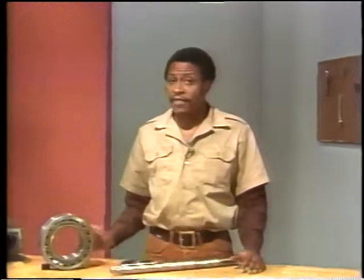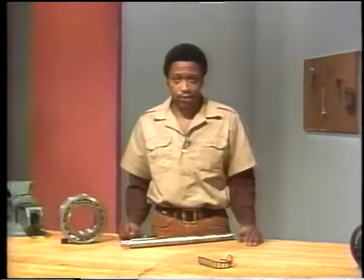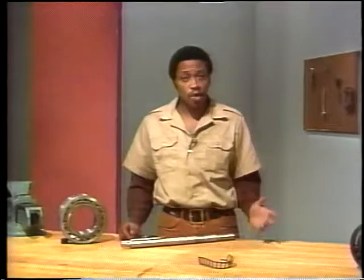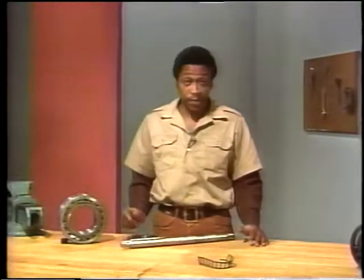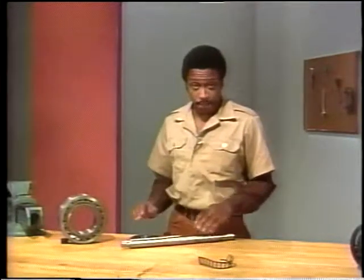When you're faced with a bearing that's failed and needs to be replaced, there are a few things you should check out. What it looks like, how it happened, and what caused it. It's important for you to notice these things because if you know why the bearing failed, you can take whatever steps are necessary to correct the situation. There are several types of bearing failure. Now, we're going to cover fatigue failure, lubrication failure, thrust failure, and misalignment failure first.